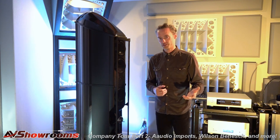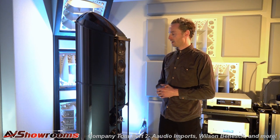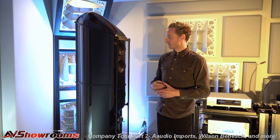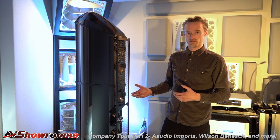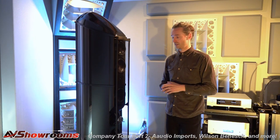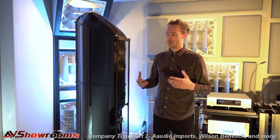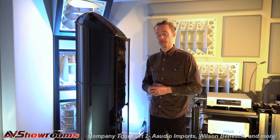All of the characteristics were probably conveyed in the film made a short time ago showing the loudspeakers performing. It's important to combine that carbon fibre material with the other components we create — aluminium components in the baffle, top plate, mid plate, and the foot. These aluminium materials are not particularly well damped, and that's why we combine them with the carbon fibre. That's the critical element here.